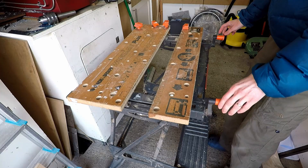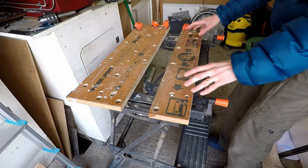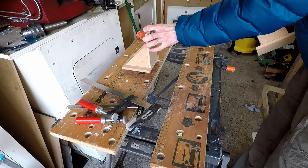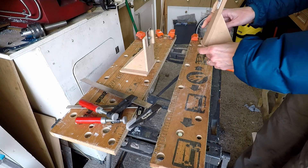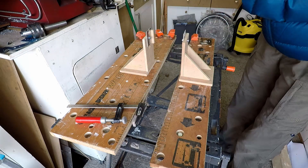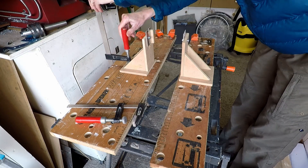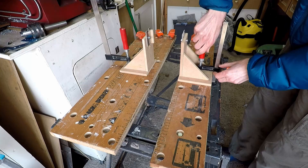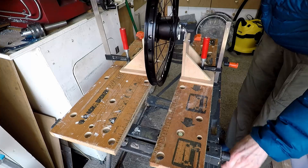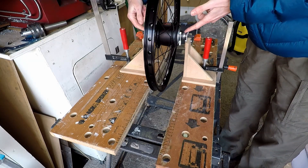It's the next morning, and the next thing we're going to need is a standard workbench like this with an adjustable front jaw. We can now start to assemble our wheel stand — left hand upright, right hand upright — onto the workbench like this, and we are going to clamp them into place using clamps. The reason we have an adjustable workbench is we can move the jaws to bring the uprights in and out and adjust the fit across the lock nuts.